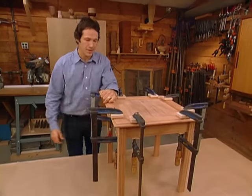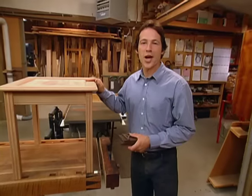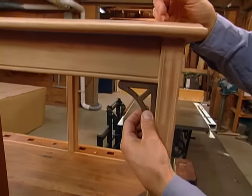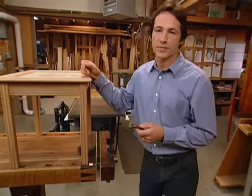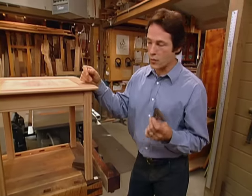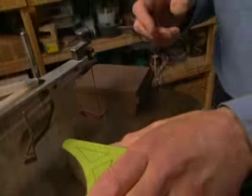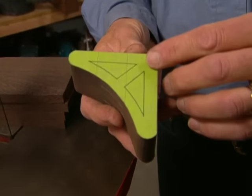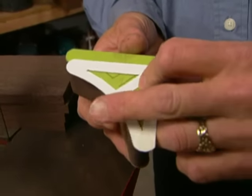I'll give the glue a couple of hours to dry. Now we're ready to add a final accent. We're getting ready to make these accents that will go between our legs and our apron. We're going to make these out of an African hardwood called wenge. Wenge is kind of expensive — about $14 a board foot — but it's only going to take a few dollars' worth, and that will add a tremendous amount of value to our side table. We need to make about eight of these, so we're going to use a technique called batch cutting. Here's a stack of four pieces of wenge that we double-stick-taped together, and we cut the exterior shape on the scroll saw. The green tape on the top of the stack makes it easier to see the layout lines, which were traced with a pencil from a template.